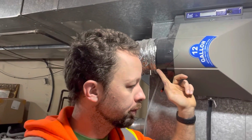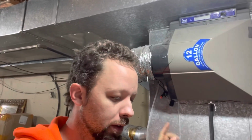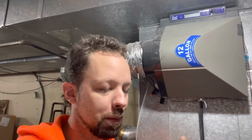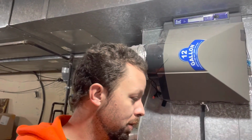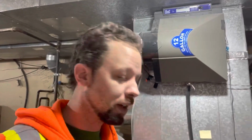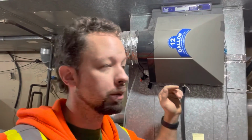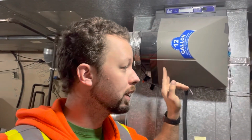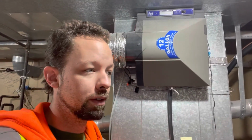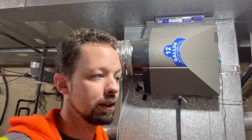And that's it. So you connect the common from here, from the water relay that turns on the water to come down for your furnace to pick up the air through that, and then the water adds the humidity, and that comes down to the common for the furnace, and then the power for the signal. It's only like 12, 24 volts, whatever it is, from the Nest thermostat that actually powers that relay, and then it turns on, lets the water flow through when the furnace is on, and then it turns off when the furnace is not running or asking for heat or anything else.